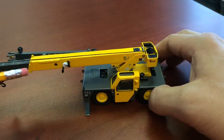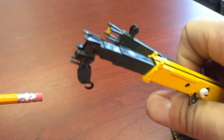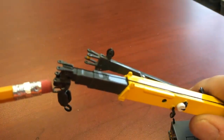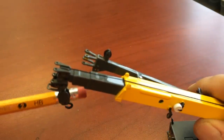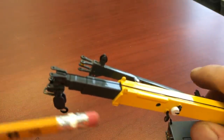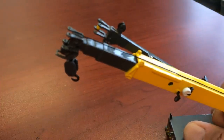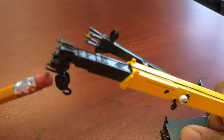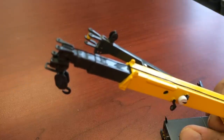This right here will be your reel for your anti-two-block system. There'll be a wire running up in here. As you can see, your hook is hanging right here, and there's a shoe right here that moves up and down. What happens is, if you're lifting a load and you're not paying attention and you keep lifting, your block hits this shoe, it pushes on a lever for a switch which is hooked to right here, and the wiring runs down to the hydraulics and shuts your hydraulics off. The reason for that is, if you weren't paying attention and you had a load lifted and you accidentally kept pulling the lever, the block would hit the shoe, and if it didn't shut the hydraulics off, you could actually break the cable and possibly drop the whole load to the ground, hurting somebody.